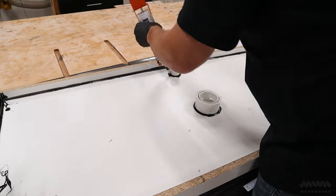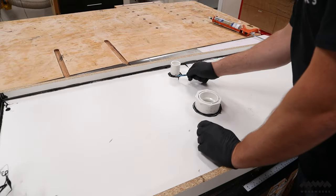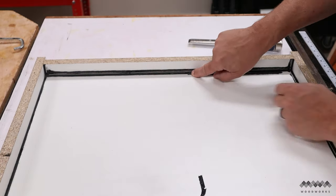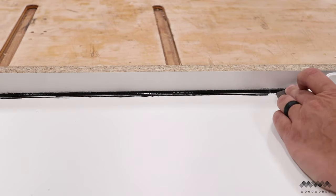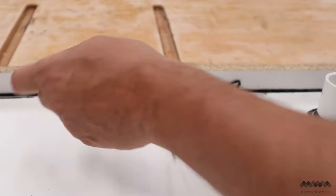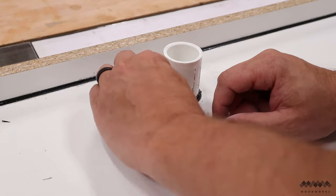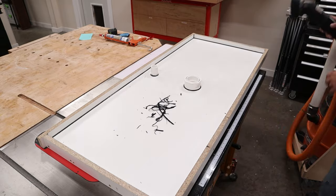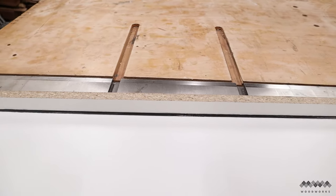I make sure to get around all the seams inside the mold where water could escape, including around the PVC in the center. Silicone cleans up really easily, and the fondant ball does a great job of separating the waste silicone from the bead. I used a chisel to slide underneath the silicone and peel it right up, and a Scotch-Brite pad works like a magic eraser to clean off any remaining residue. After a quick vacuum, I'm left with a nice clean bead all the way around the mold.